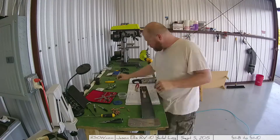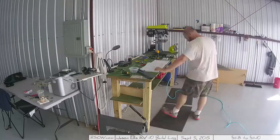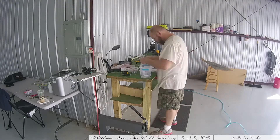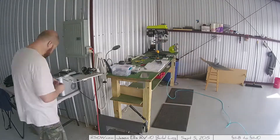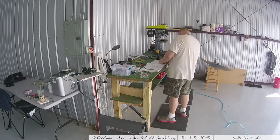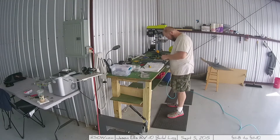Lynn, who's a fellow a couple hangers down from me, built an RV-10, and he was telling me that this trim assembly is bizarre — and sure enough here's Lynn now in the video. He goes over it and says yeah, this is a really bizarre system. It operates on a bell crank which is kind of a cam, and the left and right trims move at different speeds, which is really strange. Both trims start fully down at 35 degrees, which is what the instructions recommend. Having the trim fully down is nose-up, because it's trim.